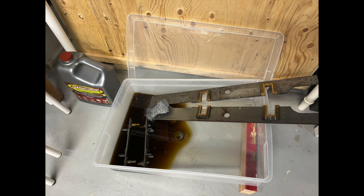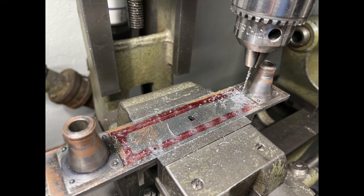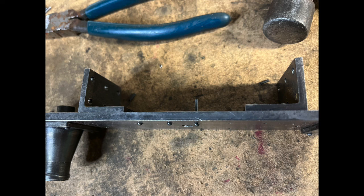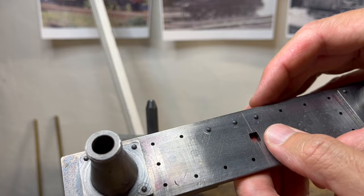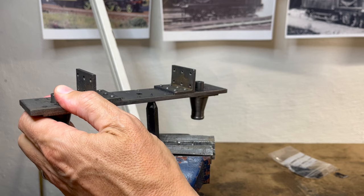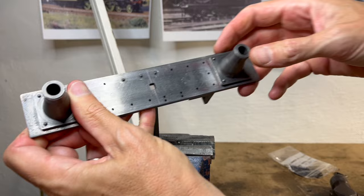Further images here: using some photos of the prototype, I marked out where further rivets appeared in the front buffer beam and drilled holes for those, fitting one-sixteenth blind rivets. They're cosmetic — they don't provide any fastening function, just to try and make the model look a little bit more realistic. I've included a short video of how I went about using a rivet snap to peen over the back of those rivets. The trick is to keep the plate material as perpendicular to the snap as possible so as not to mark the surface. Unfortunately I did do that in a couple of instances, but with painting and a little bit of filler that will not be visible.